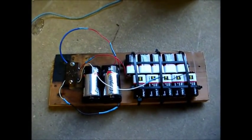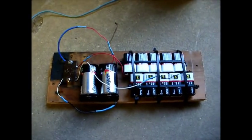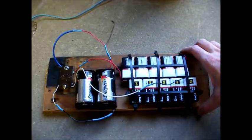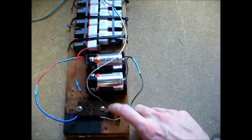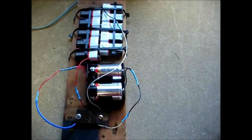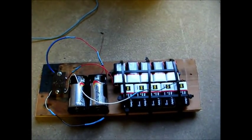Here's a closer look at the battery pack. I made no effort to make it look pretty or compact — obviously it could be made smaller, and if you were using this in a portable suitcase-style tube radio you'd probably want to do that. I got the battery holders from Radio Shack and the batteries from Dollar General. This plug I salvaged off an old Eveready battery. If anybody knows a source for this type of plug, I'd really appreciate it, because 95% of farm radios from the late 30s through early 50s use this type of plug.